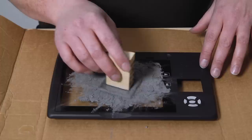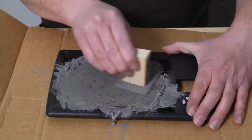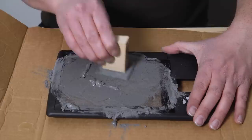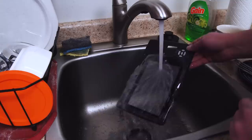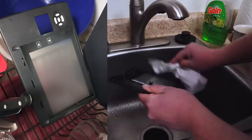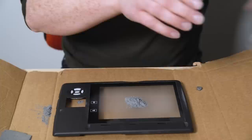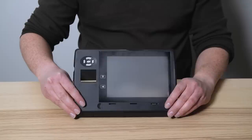Now take your tool and start rubbing the glass on the scanner glass. You'll notice right away that you're creating a lot of grinding — we're roughing up the surface so it turns into a ground glass that can capture the image circle of a lens. Make sure to grind the glass evenly for about three minutes. When done, rinse the grit off in the sink and dry it. If any patches look uneven, add another spoonful of silicon carbide with water and grind again focusing on those spots.